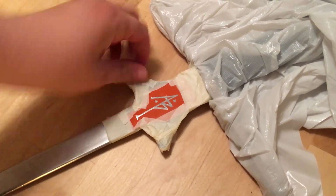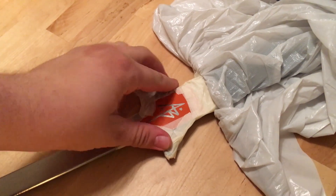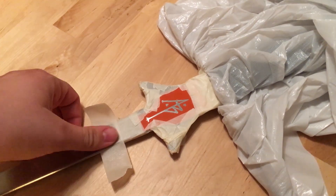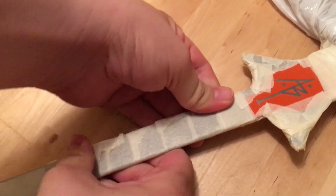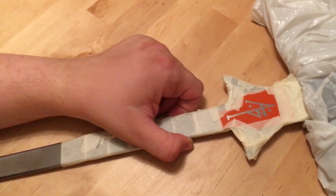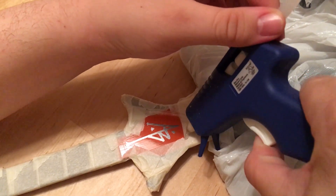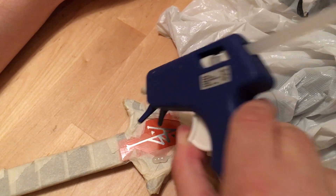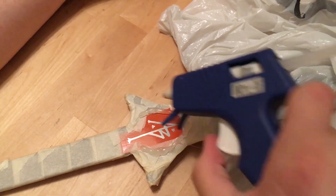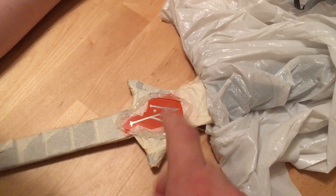You can see the plastic bag is taped up here. All the metal's covered on both sides. There are no easy seams for acid to get in, but again, I'm not dunking it, so I have to be careful. I'm going to continue adding some strips down here, about six inches or so past the ricasso. The last thing I'm going to do is take my hot glue gun and make a little reservoir. This was just a last-minute idea to keep everything a little more contained. And there we go — we've got a little acid pool.